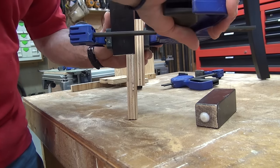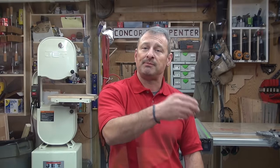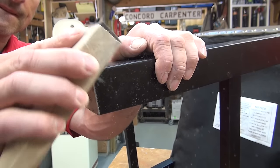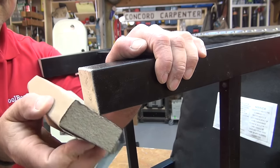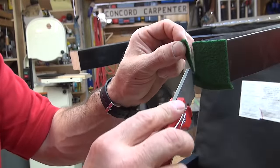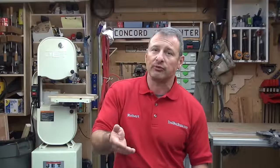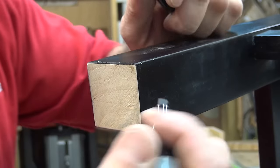Once I'm done cutting that leg, I take the jig off, place a support stilt under it, and move to the next leg, repeating the steps. When it's all said and done, I used sandpaper to break the sharp edges and clean everything up. I used green self-sticking felt to protect the chair from sliding on hardwood floors. You can also use a black Sharpie, stain marker, or stain pen for any scratches from cutting.